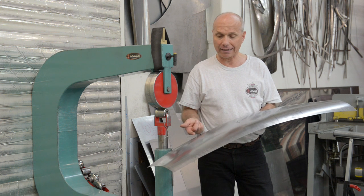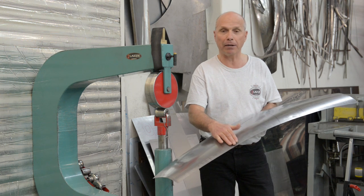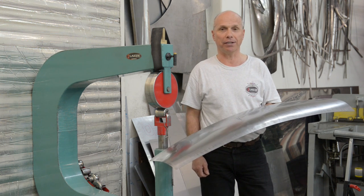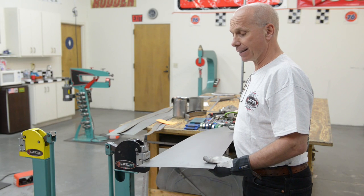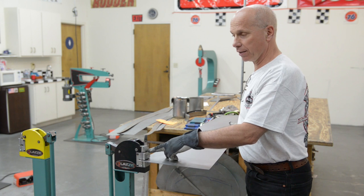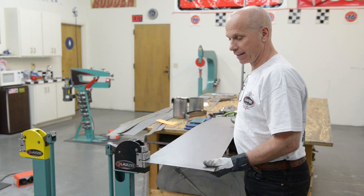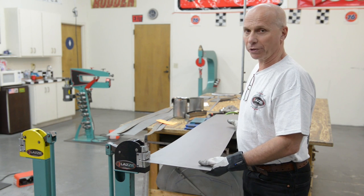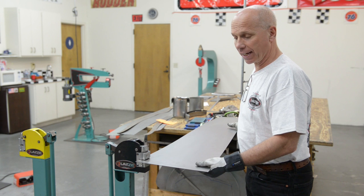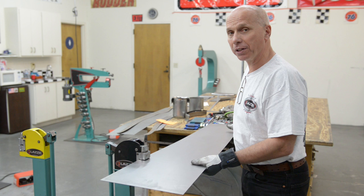The good thing is that you can use the small shrinker and just help it on the edge a little bit and the rest is done with the English wheel. So I'm over here using the small shrinker on this side. The reason why I do that is I still like the small shrinker and stretchers, but here I have a stop in there so I can go the same depth all the time, which helps me to be more consistent with the shrinking.